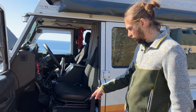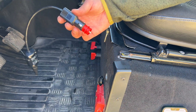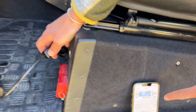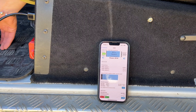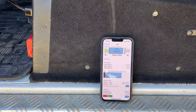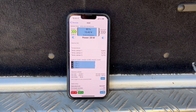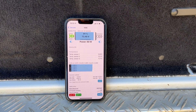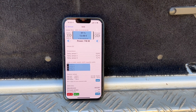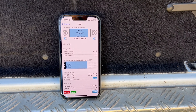Now I'll show you with both panels. Right now the roof panel is giving 40 watts — I'm going to plug the RX foldable panel in as well. Normally, within a few seconds, we should see the charge jump up. There we go — those are really good numbers. The two solar panels together are giving us 8.8 amps, 120 watts.